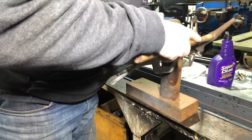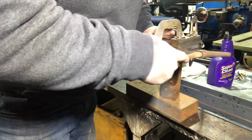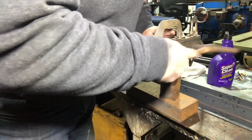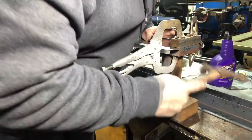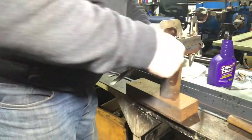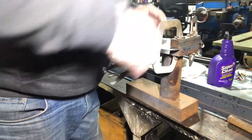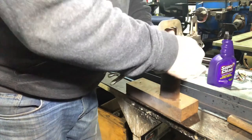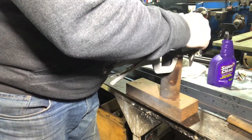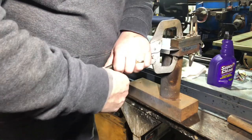You really don't need a lot of fancy tools, although they're nice to have. For stuff like this it's pretty simple. This is very soft material — it just takes a little bit of effort to form. The reason I use a hold-down on all these edges is, especially if you have a bend or a convex shape, the metal likes to back up and you get this little rolled-edge-looking thing. Having something solid holding the metal down while you're hammering it prevents that from happening.